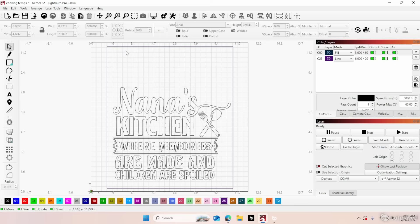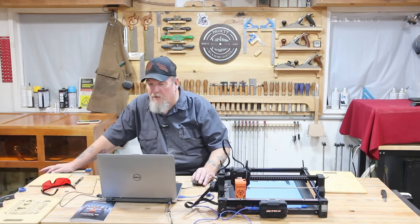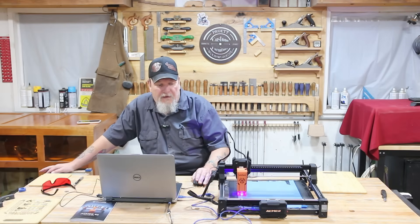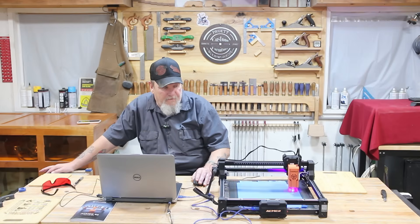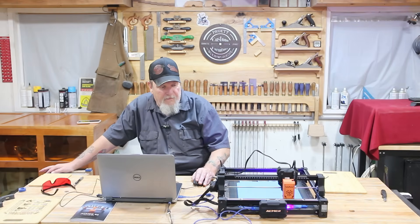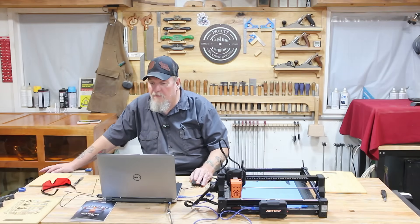This is the easiest way I have found to get everything lined up like I want. I put a little bounding box in there and then I lay tape down on my laser bed. Then I burn that bounding box — we turn off the main subject and burn that bounding box into the tape. We would just click start, and then it's going to burn and outline that into the tape. Just like that, and we now have a perfect spot to put our work piece.